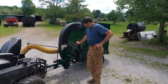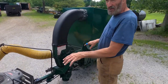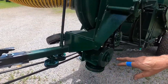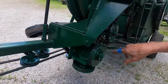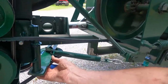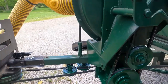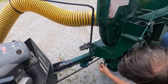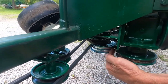We're back again. I did some modifications like we talked about on the last video on the problem I was having with the belt drive system. I think you remember on the other video, we had a right-angle drive mounted on here. I finished all that up. We've got the belt drive up here, the belt going around the idlers. We have a spring-loaded idler here — this is a belt tensioner idler that moves. What that does is, when you steer the machine, it maintains the belt tension because you get a little variance on the length of that belt. And we have a stationary idler down here — this one doesn't move when you turn. This is on the torque side of the belt, by the way.